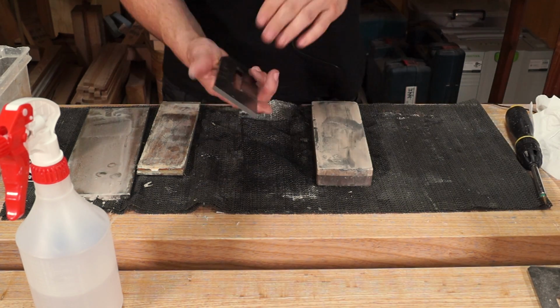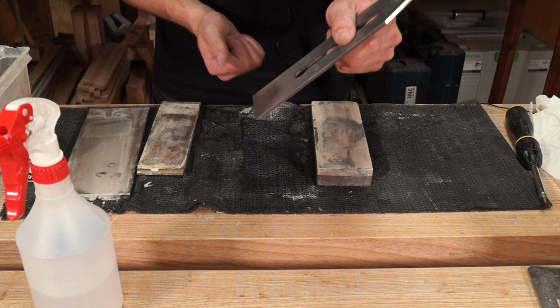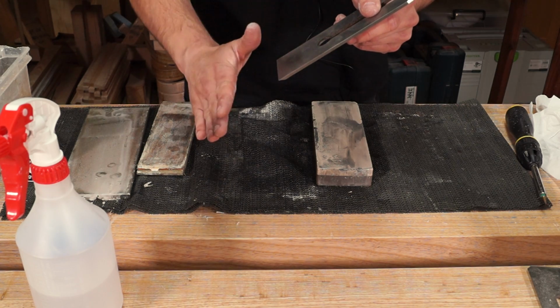So if you're working with a standard bench plane, like I said at the start, this bevel is mounted underneath. So we're going to need to sharpen a back bevel on this. Now that means that we obviously have two angles that we need to sharpen. Firstly, this one on the bottom, draw the burr up, and then we need to flatten the burr off this